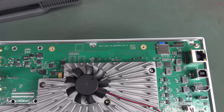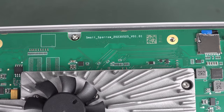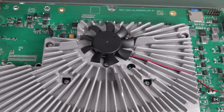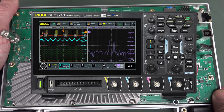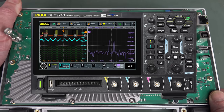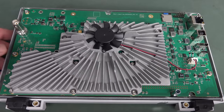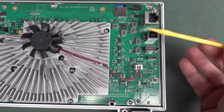Oh, how cute — the Small Sparrow! Version 23.0525, version 1.01 for those playing along at home. There is some unpopulated memory. You've got to remember, this thing is also available as the DHO 900 series — the difference is the 900 series is higher bandwidth. This one only goes to 100 megahertz; the 900 series goes to 250 megahertz. And it has a logic analyzer option, which is really interesting, because neither the 1000 nor the 4000 have a logic analyzer option, and a lot of people complained about that.